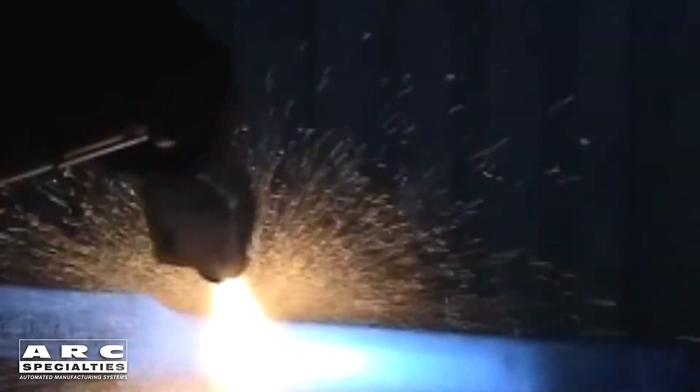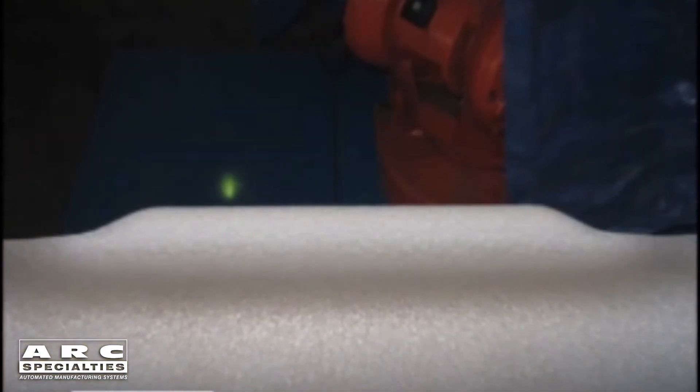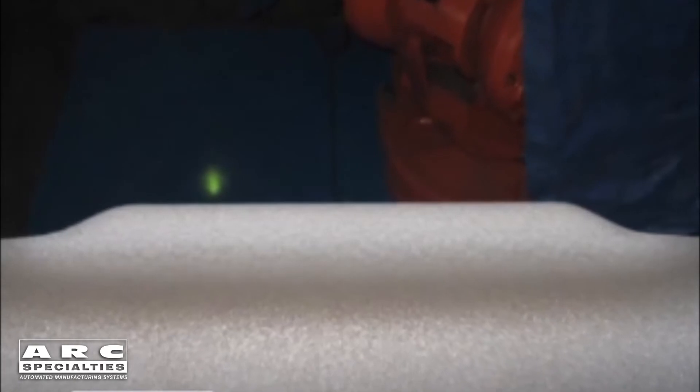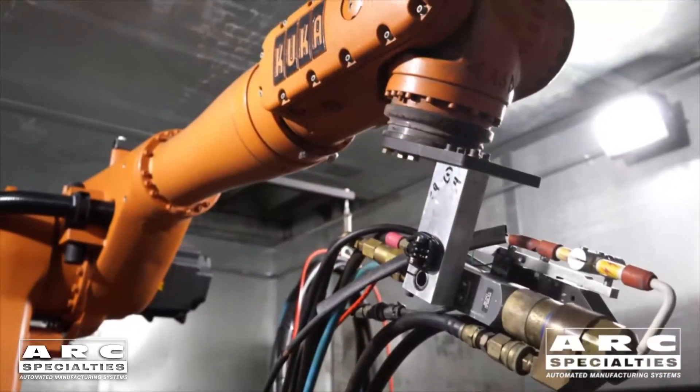This is an unusual wire — we can create not just coatings but thick sections. So we're not just putting a hard coating on this; we're actually creating ribs which stand up over an inch. Normally these ribs are formed by machining away most of the metal from a heavy wall pipe, then heat treating, and then doing the final hard facing. By building these ribs up, this is like additive manufacturing — you're creating the exact rib shape you need while at the same time creating the hard coating that will prevent wear as it rubs against the rock.